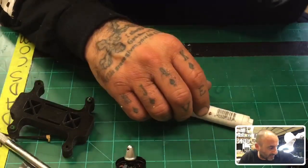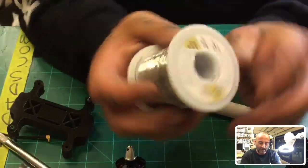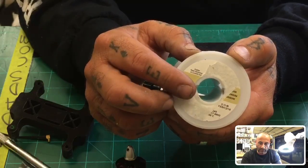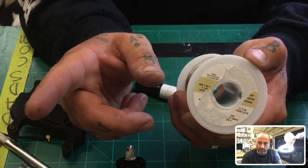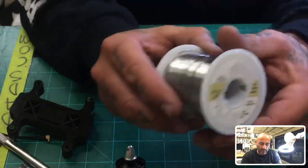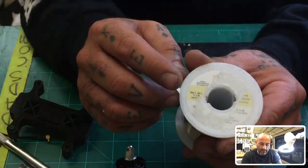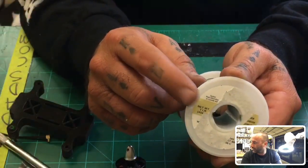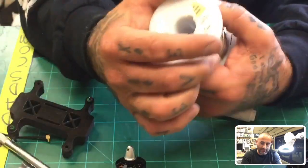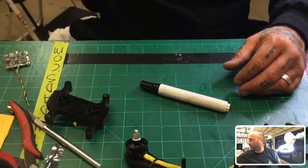These are two things that are going to be critical. The next thing that's critical is the Kester 6337 solder. I peeled the label off, but I've shown this quite a few times. I didn't mean to peel it off, it just got stuck on something. Now, I sent some to Julio in California, and Julio, I think you may still be on right now. He said he burnt some. There's a night and day difference between using proper solder like this and using some of the other stuff I see people using. The melting, the cooling, everything about it is different. So get yourself some of that.